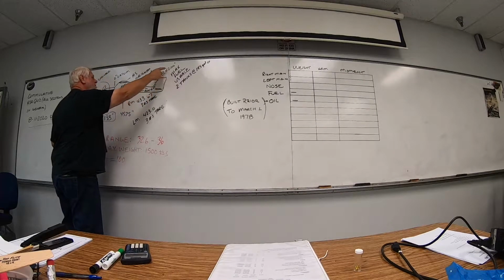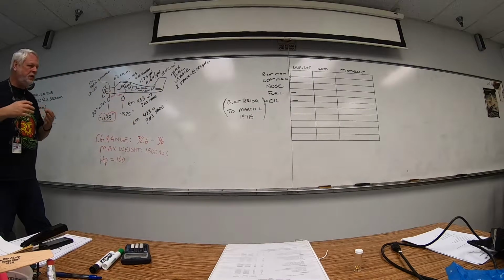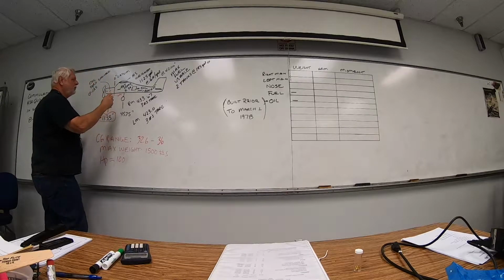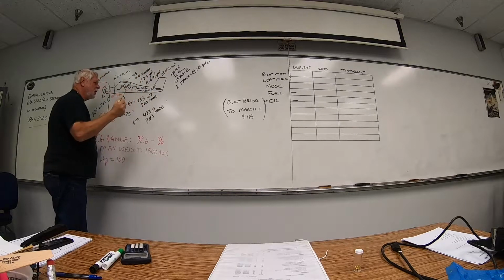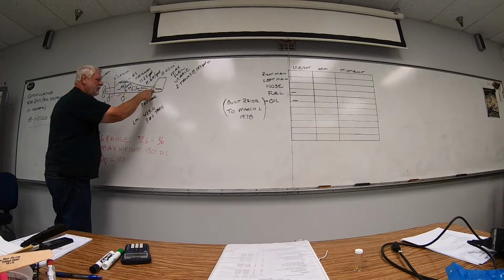Now that is unusable fuel. Usable fuel. The unusable fuel is part of your empty weight. So we have 11.25 gallons of usable, drainable fuel at station 42. That's as weighed. We have a baggage compartment, 80 pounds maximum capacity at 65 inches.